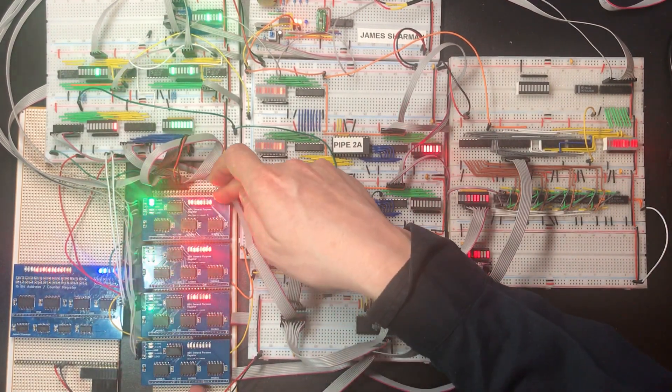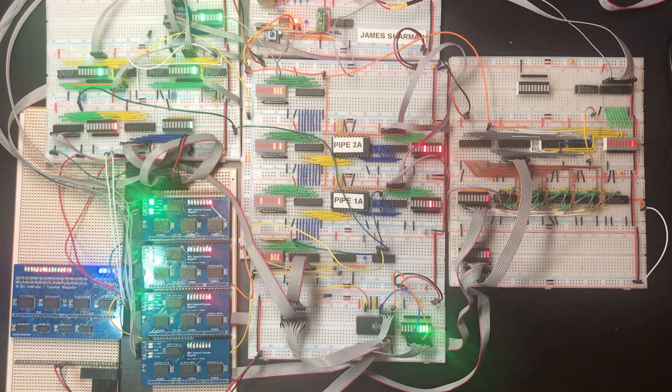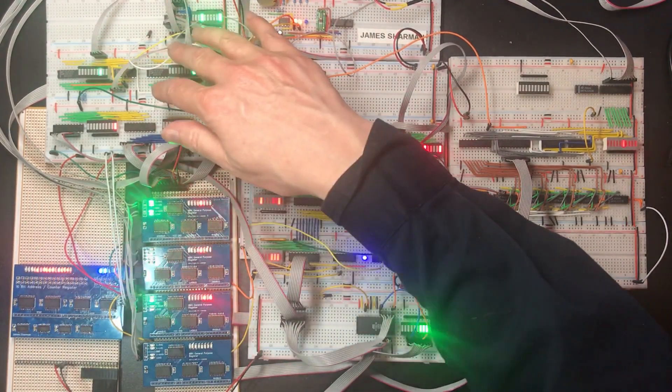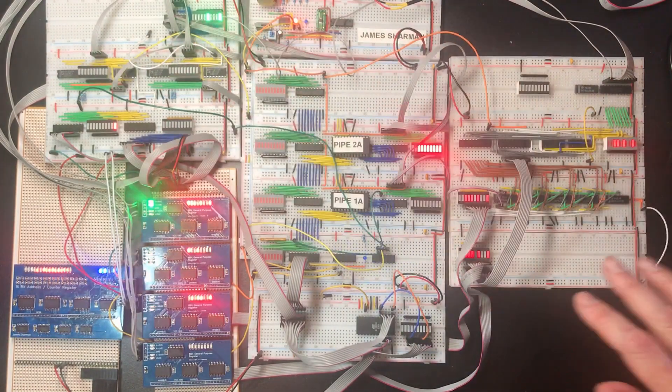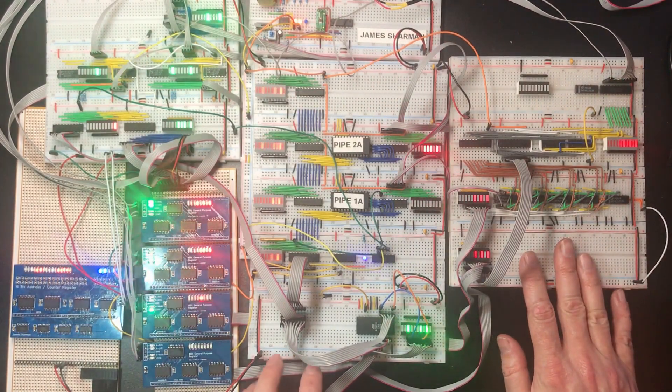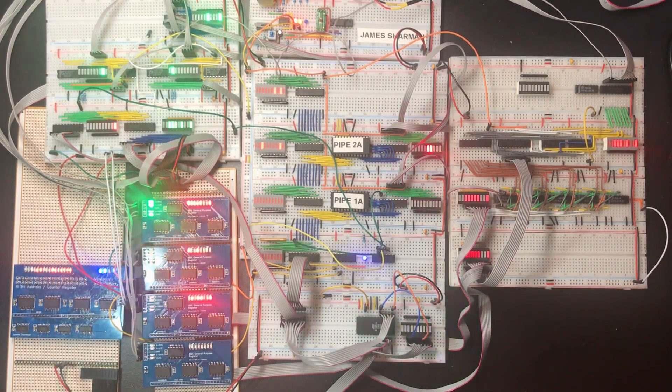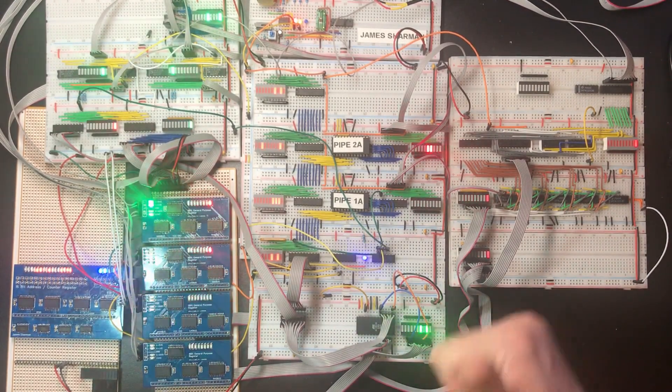Then I'll be putting a full set of these in, and we can actually start messing around with the full 16 bits of address. We'll gain the ability to move data between the address registers and then we can start looking at things like a jump instruction. I am very, very happy with this. These four circuits here are the first complete section of the processor. I'm expecting these boards to remain until the end — we'll get a new backplane, a new connecting circuit, and new address registers. We've still got a bunch of work to do for driving address registers, we've got to finish the ALU, and put the proper memory in. But this is all going very well. Thanks for watching. Goodbye.